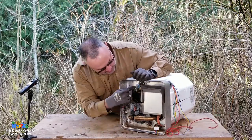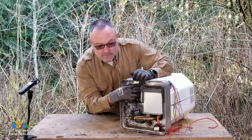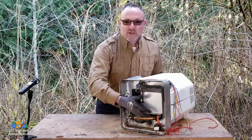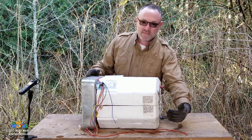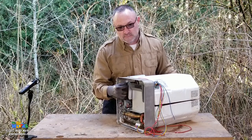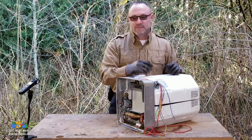So that's the story with the pop-off valve. The rest of the stuff we're going to come in on following the trail when we talk about the AC/DC side. So on following the trail of the water, cold's coming in. It goes into here, hot comes out. We talked about your bypass valve. We talked about the check valve. We talked about the pop-off valve, okay? And we talked about draining it and back flushing it and the different wands.